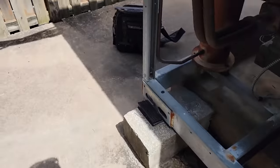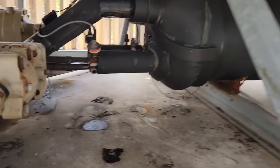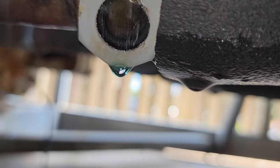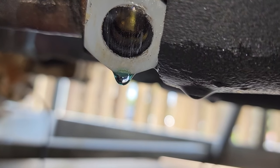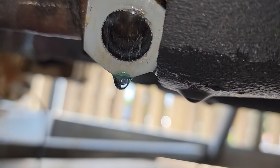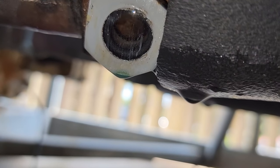All right, the test has stopped. We're going to re-enable it one more time now that the refrigerant is equalized. This will automatically go back to disabled when the test is finished — enabled again, enter. It's just actuating the drive on the valve. Yeah, now that's definitely opening — it deadheads closed, now it's opening. You saw it open. All right, it deadheaded open, now it's going to go back closed. Right there, that's the plunger — and bam, it just deadheaded closed.